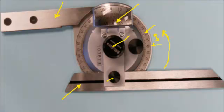We have a lock nut here, so if we unlock this nut, we can then swivel the blade, swiveling the main scale to whatever angle we require, and then we can tighten it. This is a fine adjusting wheel, so once the lock nut is unlocked, we can use this to dial the angle in to whatever degree we require.